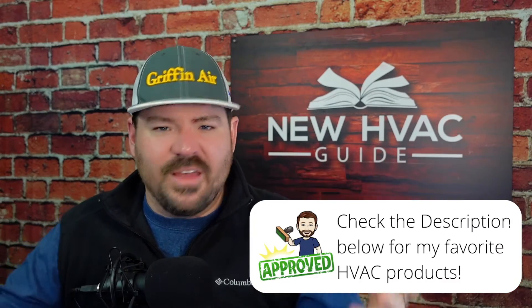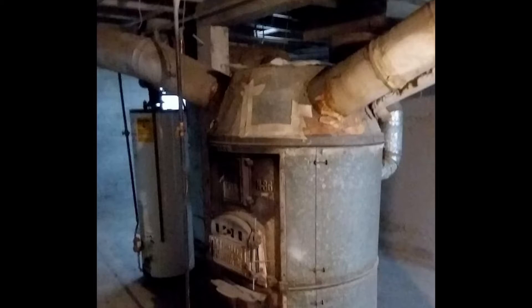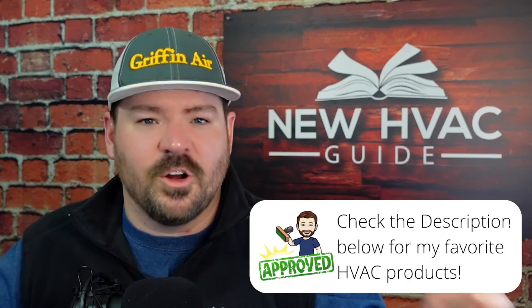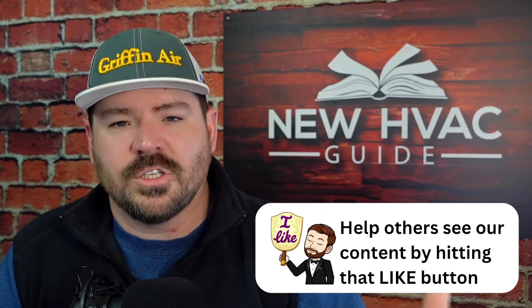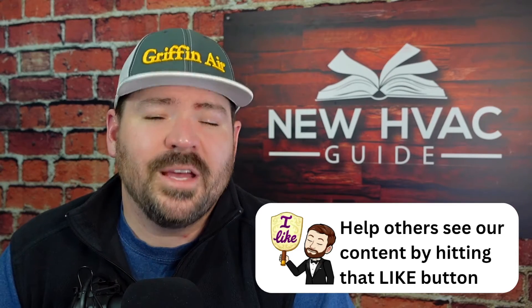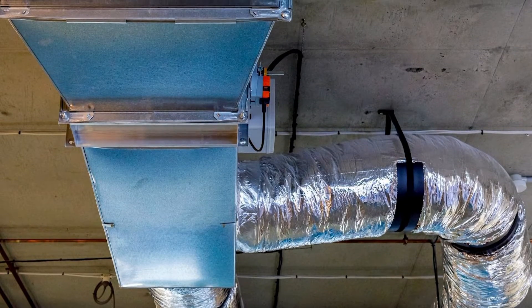In the old days they had big beefy fan motors — think of some of those old oil furnaces — they didn't care about high static, they'd push air through the tiniest holes. They were bigger, beefier, less efficient equipment. Now that we're moving toward more efficient equipment, proper airflow, static pressures, and air across that coil become more paramount. If you've got ductwork that's not sized correctly — say it's undersized — that becomes a bigger deal than it used to be. So that gets back to not just inspecting the ductwork, but when you're getting other opinions, making sure it's sized properly for the system you're installing in that space.